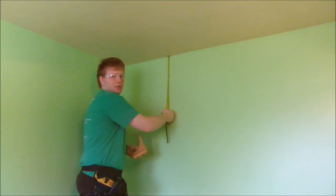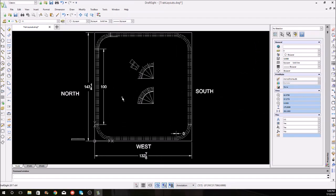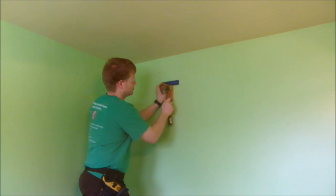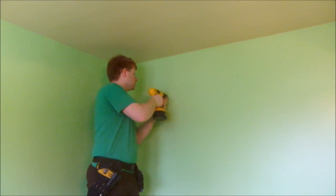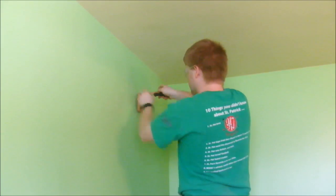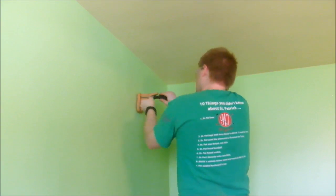I'm starting with the four corners of the room. I did a full CAD layout of the room so I know theoretically where the brackets are all supposed to be. Here I'm marking them out, leveling them up, and then I'll tap the screws to mark on the wall where I need to drill. Now I can put my drywall hangers in.